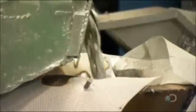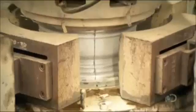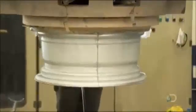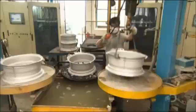Right before casting, the molten metal flows through a filter sheet made of high-temperature-resistant ceramic. This traps additional aluminum oxide. Once cast, the aluminum takes about seven to ten minutes to solidify. Then the mold automatically opens, releasing the newly cast wheel.